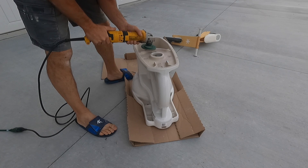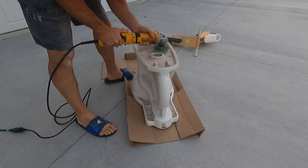If you've never done it before, installing a toilet is not too bad. It can be a little tricky on a concrete floor, but grinding those little flanges off on the bottom works great — I've had no problems doing that. Just make sure you use a diamond blade on your grinder, take your time, and it'll grind that porcelain right off. That allows the outside flange of the toilet to sit on the floor and gives you a nice solid sitting toilet. We appreciate you guys watching — we'll have a lot more content coming soon as we're finally getting floors and stuff put in, so stay tuned and we'll catch you on the next video.